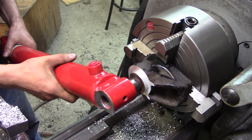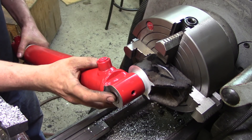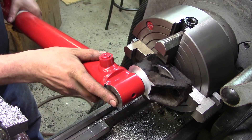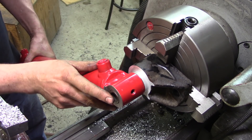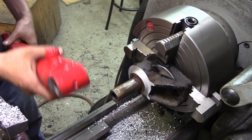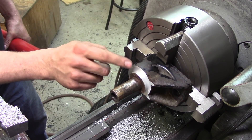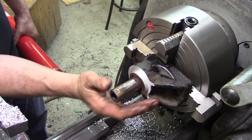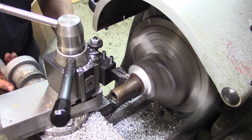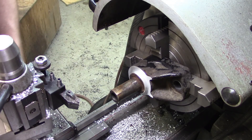Who knows what grade of aluminum this is. I can feel the end of this stub here — it's just barely sticking out, actually flush with the back side. We can now swing this cylinder all the way around, so when the big bolt with the big washer goes on here, that allows this to pivot in relation to the frame. I'm just going to take one little skim off here to chamfer this edge just a little bit, then file the outside just to take the burr off, and that part's done.